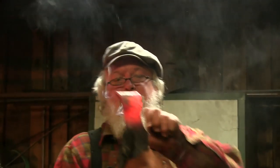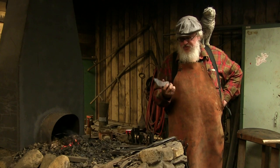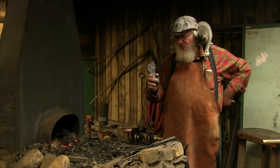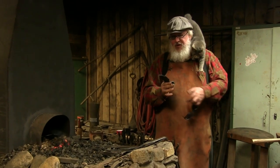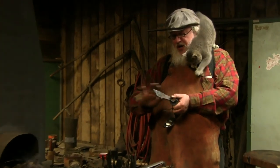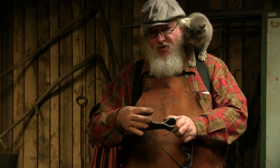Alright, so there's our eye. This is cooled down now, and I've taken a soapstone and kind of traced out what I want the final hawk to look like. So I'm going to take the oxyacetylene torch and trim that down. Then we're going to take the grinder and shape it a little bit. And then we'll put it back in the fire and actually forge the edge down.